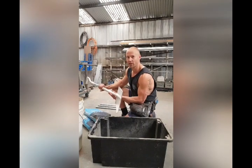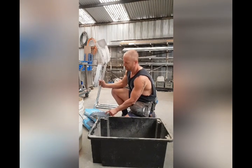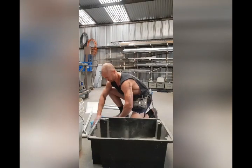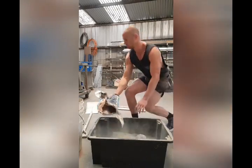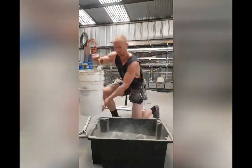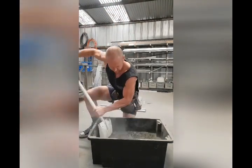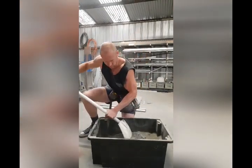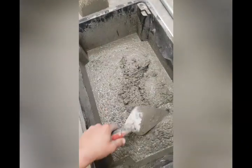So now it's time to mix the concrete up. Per bag, what we're after is about 2.5 litres of water, and the consistency we're after is kind of like toothpaste. Alright, we're set to go — look at that beautiful consistency, that's what we're after.